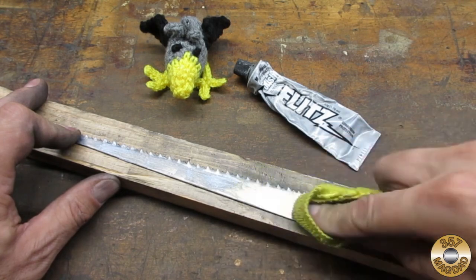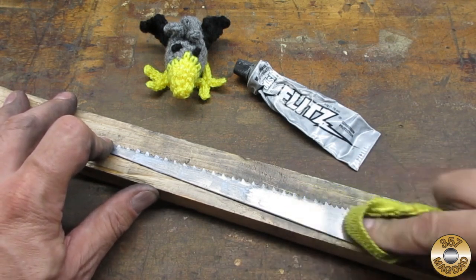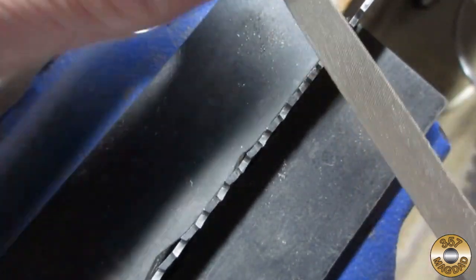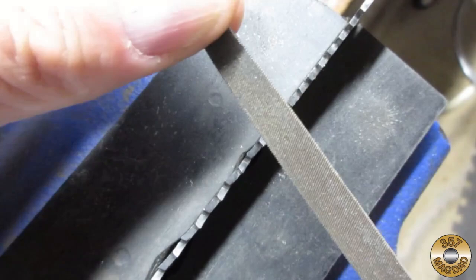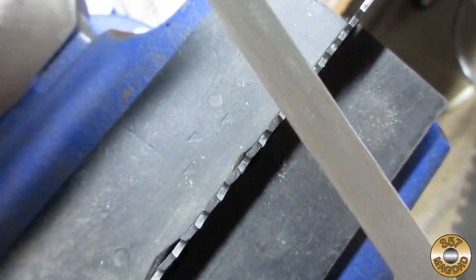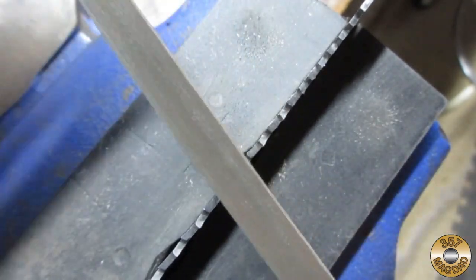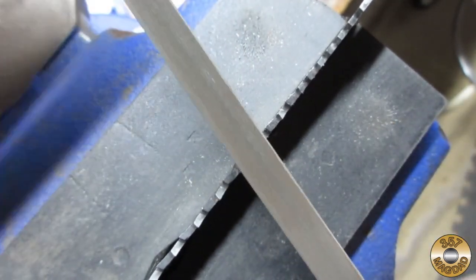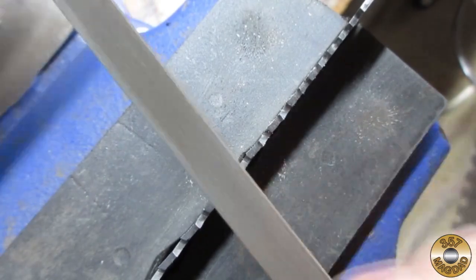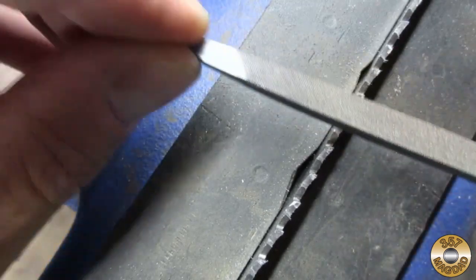Chuck and I gave the blade a polish by hand with the flitz. If you want a saw sharpening lesson, I would recommend Paul Sellers' videos. Basically, you use a triangular file and sharpen the teeth that bend away from you. I try to follow the angle that is already on the teeth. Then I flip the blade around and do the teeth I skipped at the opposite angle.